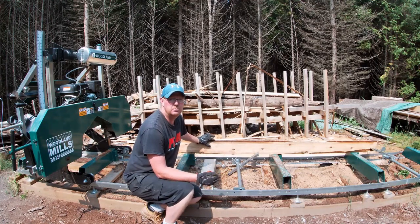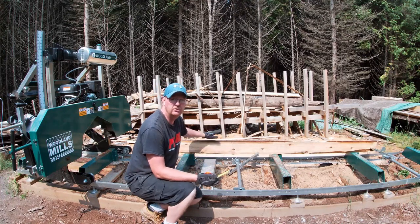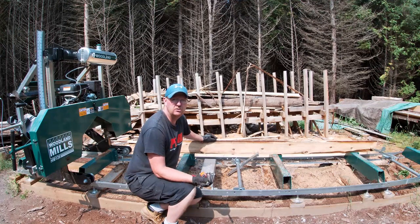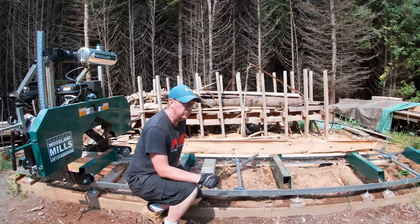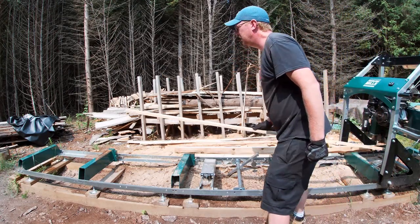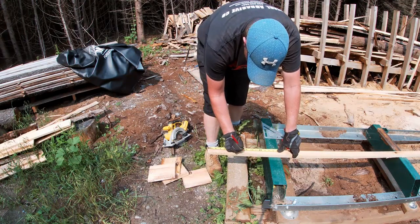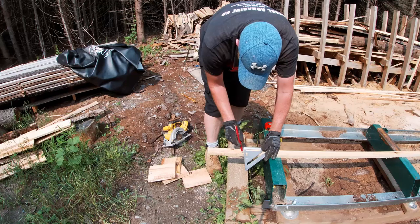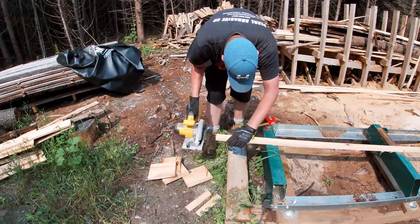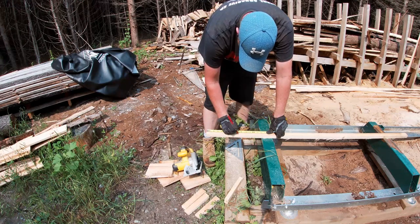Now I'm taking some one-inch lumber and I'm going to rip this down to an inch and five-eighths. This measurement is fairly important to get quite accurate because the jig is going to go around the log stops, so you want this to be just a hair bigger or the same size as the log stop so you get a good fit over top of them. Then I'll repeat the process and break this down into four eight-inch pieces, and lastly cut two four-inch pieces.